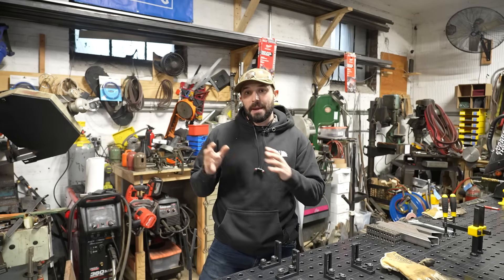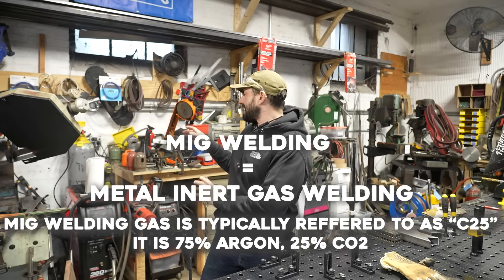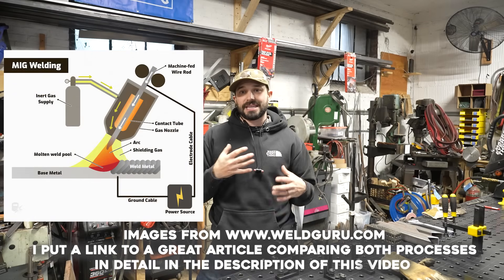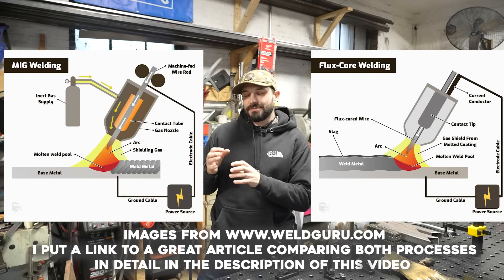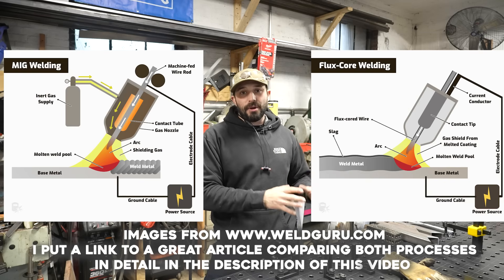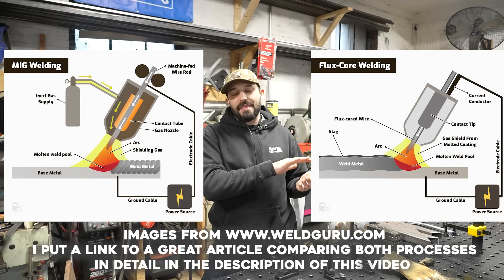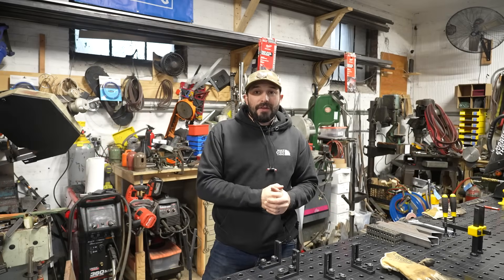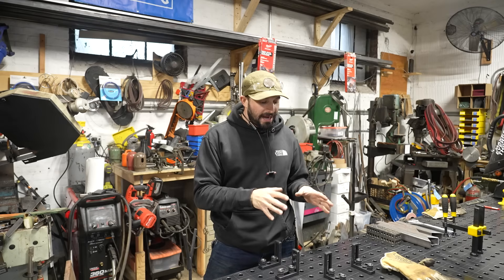The real big difference is that MIG welding has gas in the name — MIG stands for metal inert gas. That noble gas comes in the tank you see on the back of a welder and it shields the weld area so it doesn't get attacked by oxygen, corrode, or create porosity. When you flux core weld, a similar shielding gas is actually created through the combustion of the wire itself. The flux burns off, creates a similar shielded pocket, then creates slag and protects your weld from oxygen through that extreme heat. There are pros and cons of both, and a lot of people are intimidated by the gas.